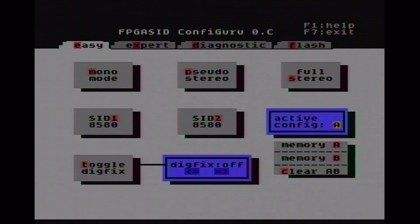The last option we have here is the so-called Digifix. This is quite important if you want to play older digitalized sounds on a newer SID chip. If you know the famous Turrican opening speech or the Outrun Europe count-in, for example, these are things made for the older SID. On newer SIDs you may not hear them or they're not as loud. The Digifix — called Dig-Fix here just due to space limitations — addresses this issue, so you may or may not use this option.